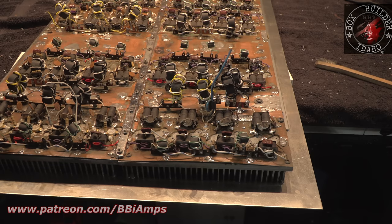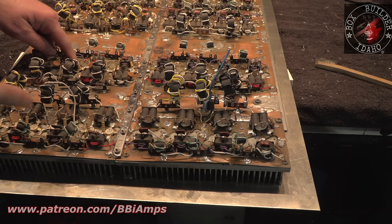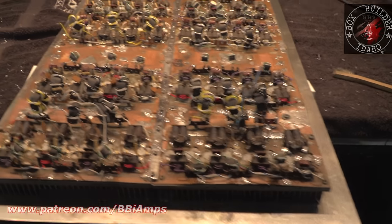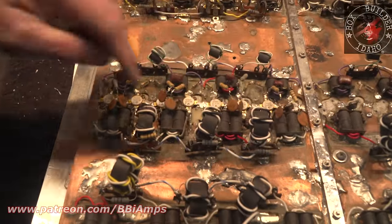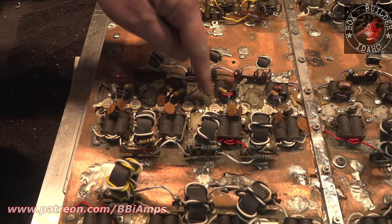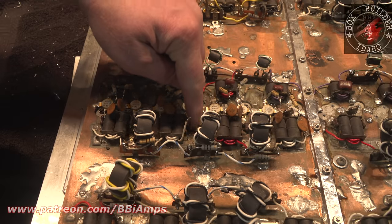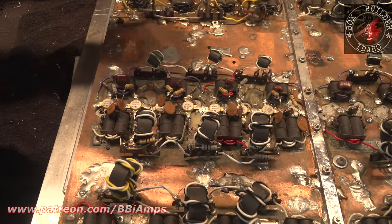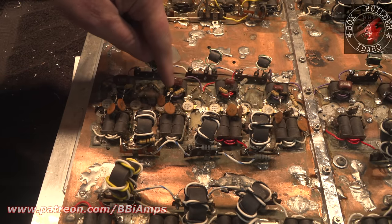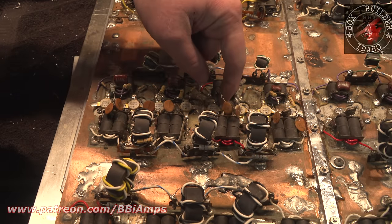We kind of have the same problem going on over here. And I think this here, there is literally no trace up here. No trace. Physically is no trace. So where's it getting ground? Not only is it the ground that powers the transformers as a reference, but there's no physical ground here. So the only way that there's ground that's present right here is what's being passed from this ground trace right here and this ground trace right here.